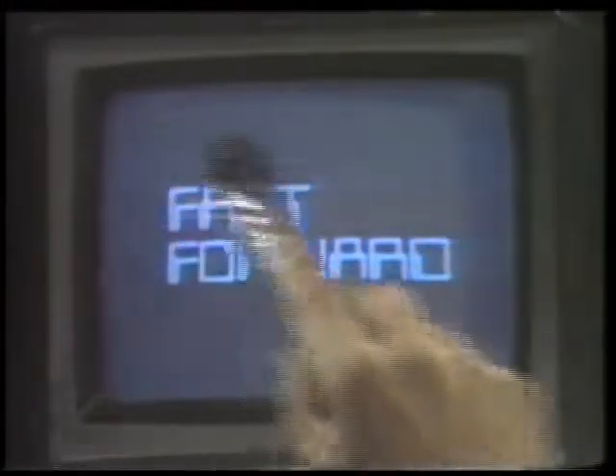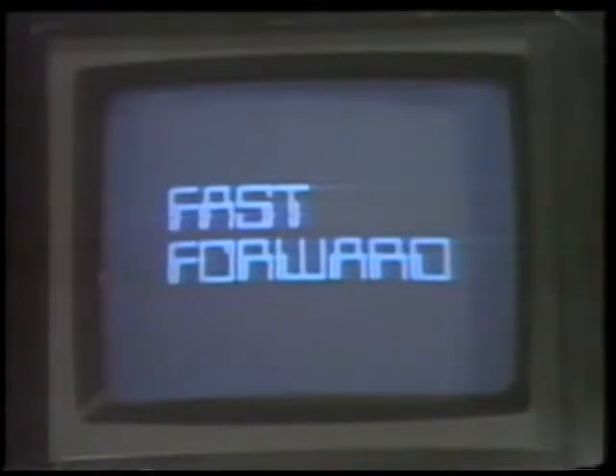It continues doing a half line up here and continues on. That gives an interlaced picture with 525 lines interwoven, except that the picture is scanned twice as often as it would be without the interlaced trick, giving half the flicker. Needless to say, at the bottom of the picture the beam is also blanked out and allowed to return to the top.